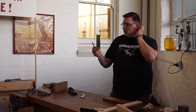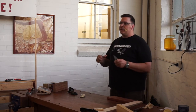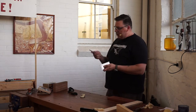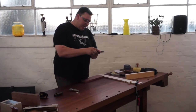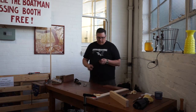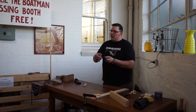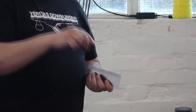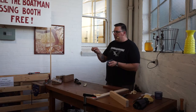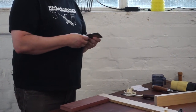A hard scraper is just a piece of spring steel, and it works really well for getting good results on harder woods. The nice thing about a scraping cut is that it doesn't matter what grain direction you work in. The easiest way to do this is to take a file and joint the edge with the file so that it's about 90 degrees. It's usually easier if it's in a vise. Once you get that jointed so that it's nice and flat, you turn the file perpendicular and do what's called draw filing — basically you're skewing the cutting action of the file so that you're getting a nice straight cut all the way across, and that actually puts a higher polish on that blade.